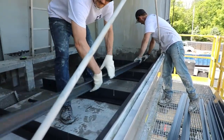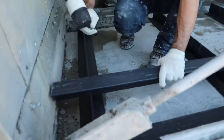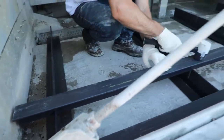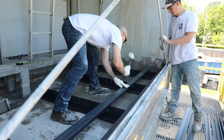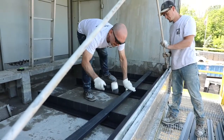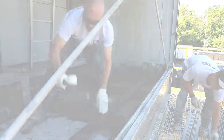Then you can simply snap in all the T-beams and fill retainers. In this case, we are installing 5-degree fill, so we need to put the retainers in with the top rib facing out. If we needed to do a 10-degree fill installation, we would rotate it so the top rib is facing in. Get all the components in and use a mallet to fully seat the pieces in the notches.